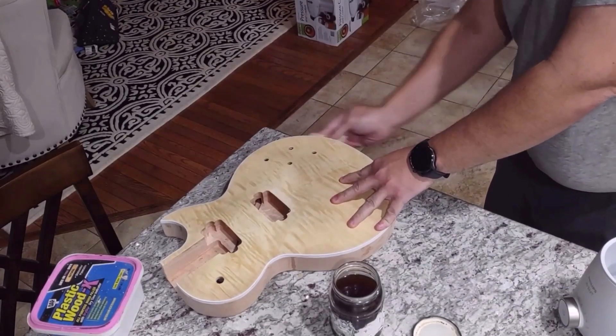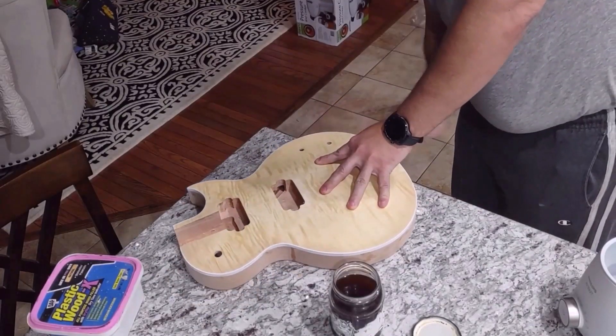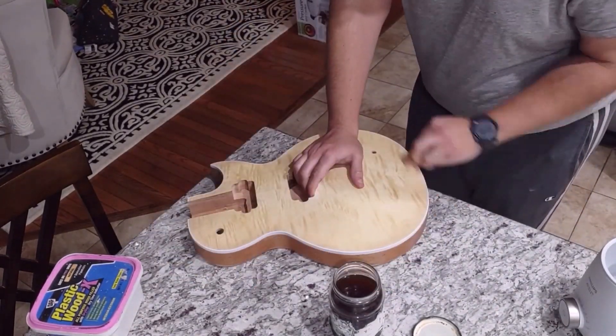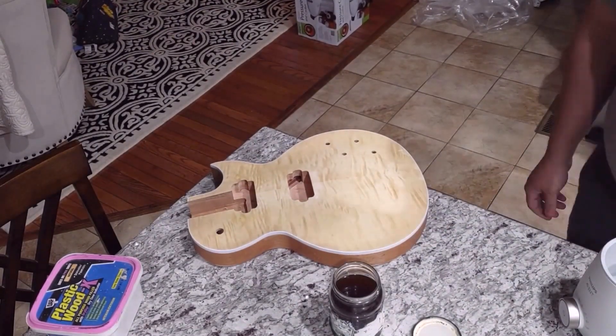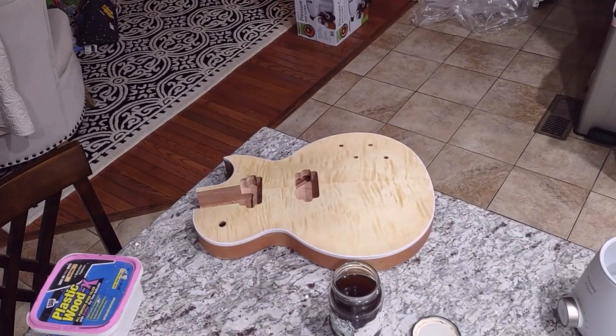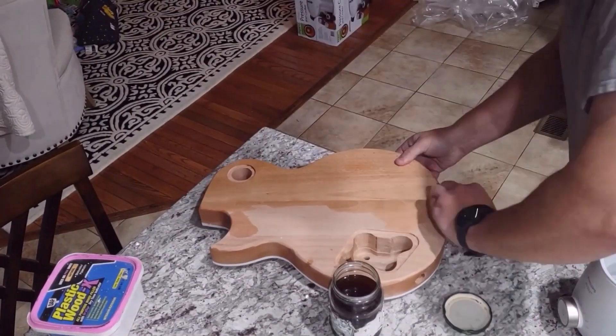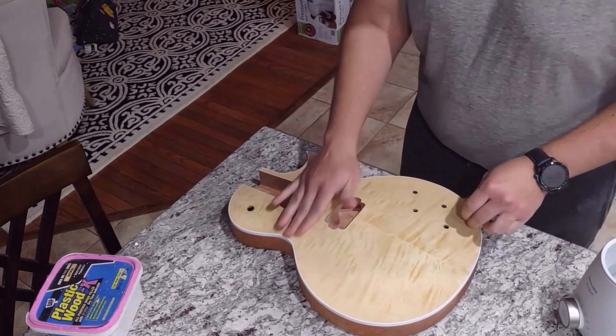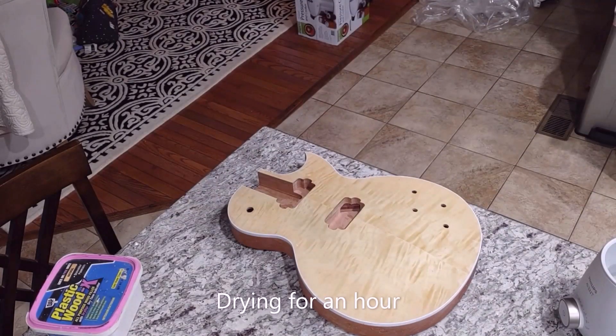We did our first coat; now we'll do the sides and the back, probably two coats total to get good saturation and give it a good opportunity to really soak in and color the wood. Don't expect very deep, dark colors with a natural stain like coffee or vinegar and steel wool. You might get a little darker with a ton of coats, but it's really more to enhance the wood you already have — make it look a little older, more distinct, bring out the patterns a little bit.